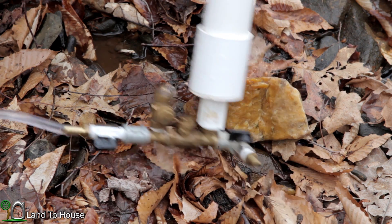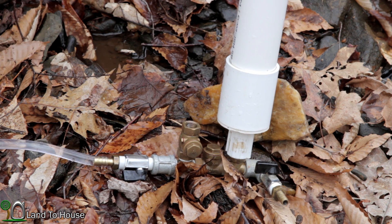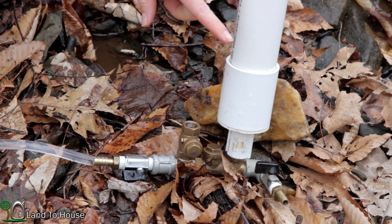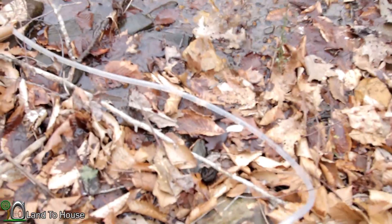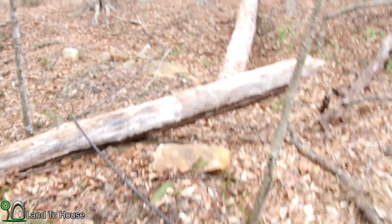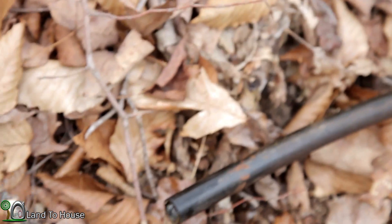Let's see what kind of pressure we have here — not bad. Next we're going to be hooking up a delivery pipe and testing out how high we can go with this setup. In order to get sufficient length of delivery pipe, I have added an adapter here to a half inch delivery pipe that will then go uphill for testing at a higher height. The delivery pipe is now full, which is going to help in getting pressure built to the pump.